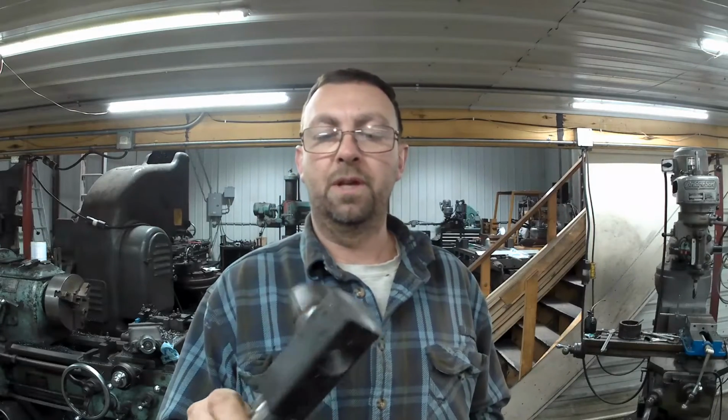Now we have our spindles welded up, bored. We just did it with a reamer. No sense in setting up a boring head. Reamers are just as good as boring heads if you have them. They are expensive sometimes, especially when you get into the shell reamers, the big ones. We've got a few that are up in the 3-4 inch range that we've done about 3 feet deep on a hole. It gets expensive when you get into that bigger stuff.